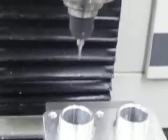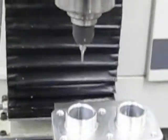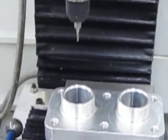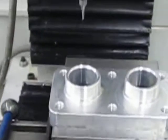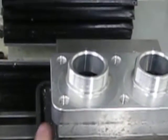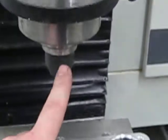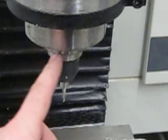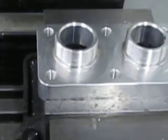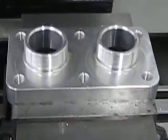So that is how you will set multiple tool lengths on this machine. For me, it's the best way. The nice thing about this is now, if I put a different part in my vise, or just set it on the table, however I do it, all I need to do is go back and touch my spindle nose — not the collet — the spindle nose, to the top of the part and set my fixture offset Z0. Then go ahead and run your program.